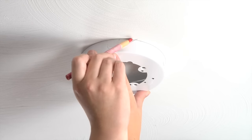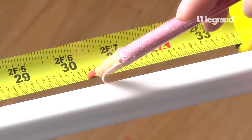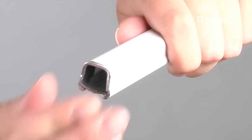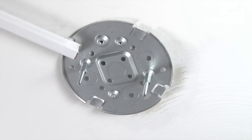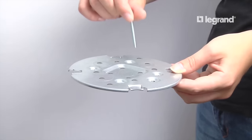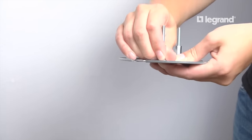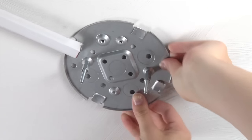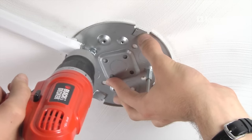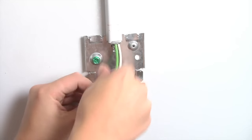While holding the fan box in position, mark its location and measure the length between it and the pencil mark at the inside elbow. Add three-eighths inch to each end, cut and deburr the raceway, and insert bushings at the cut ends. Slide the raceway onto the elbow tongue, then softly tap the raceway onto the support clip — this will hold the raceway in place along the ceiling as you install the fan box. Before mounting the fan box base, be sure to insert the long metal screws through the base and install the hexagonal standoff so they are fully tightened. These screws will be used later to hang the fan. Slide the fan box onto the raceway tongue, then securely fasten the fan box base to the ceiling joist.